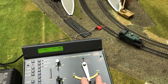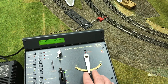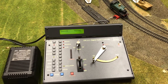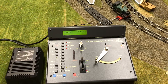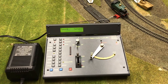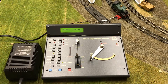You'll notice it's not very well controlled — it's pretty much fast or slow, not a lot in between. It's decided not to play at the moment, but there we go backwards again. In DC mode, forward and reverse relates to track polarity, not the locomotive direction, as you'd expect. It's very stop-and-start with DC, but they warn you about that in the manual — this isn't designed to be a DC controller, it can do it but it's not its primary function. So there you go: the ZTC 511 from Taunton Controls. It's a second-hand unit, no longer available new, but it can run DC, DCC, and our favorite Zero-One control system. Take care.